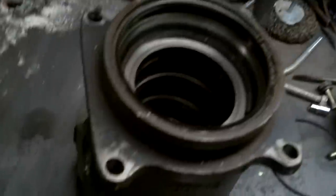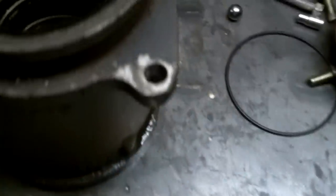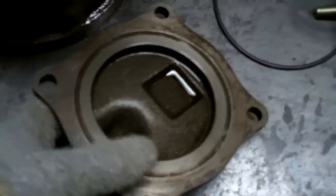On the sides there are ports to go to the track motors — those wheel motors. That's how this allows the whole system to rotate infinitely. There's no hoses to bind up; it can spin that track base around and around. There's actually that fifth port, which is probably the bigger one — it's drilled through the dead center of the thing and comes out on the bottom. On the plate that goes on the bottom of this piece is an orifice as well. It's kind of like the pressure bleed-off return-to-tank line for those orbit motors. It's a pretty slick little idea.